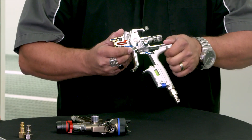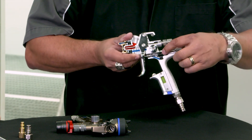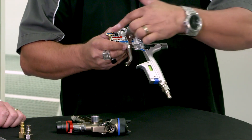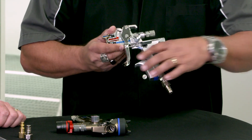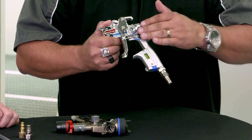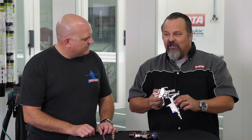If I have 100 PSI coming to this gun and I cheat that down with my air micrometer knob — nearly closed — to get down to that low pressure, the problem is inside the spray gun. When I look in the air micrometer, there's a big round hole about the dimension of a large straw that goes through it. If I have that hole fully open, air volume and pressure come through that gun into the front of it when I pull the trigger. But if I start cheating that down too far, it turns that hole away from being centered on your air passage, blocking it against the spray gun wall, and now I have a tiny hole.